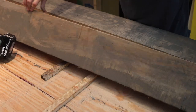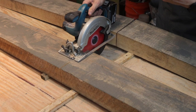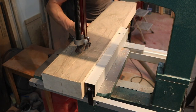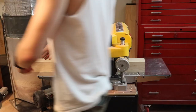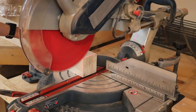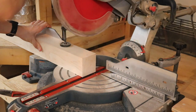You can see I'm using a few sticks on either end of the cut, which relieves any pressure or forces that would pinch the blade, so when you finish the cut the wood just falls away to either side. Repeating the same milling process for the legs: take it to the jointer to get a clean edge, over to the bandsaw to rip each piece to the same size, then to the planer to plane both faces, and finally make the initial cut on the miter saw — long for now, to be trued up when the project nears completion.